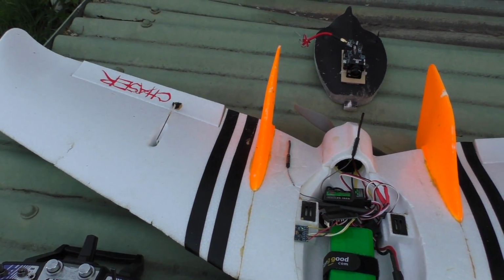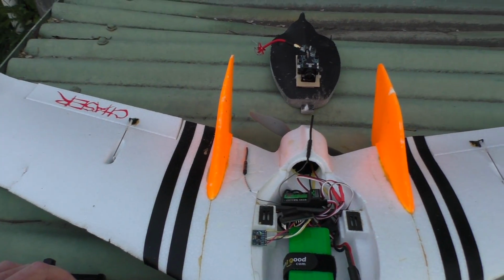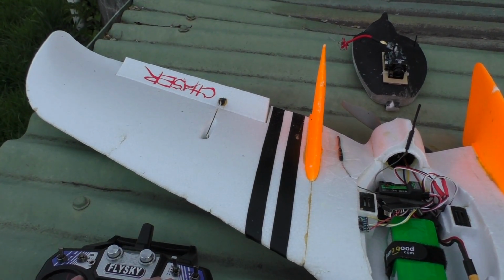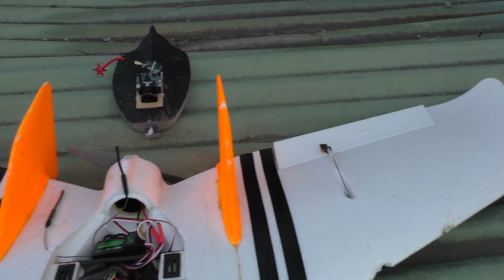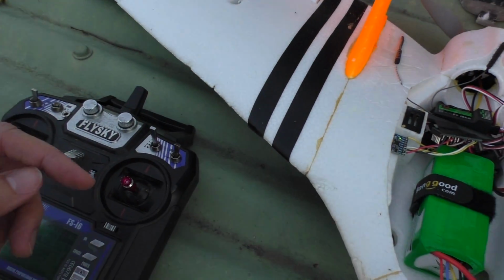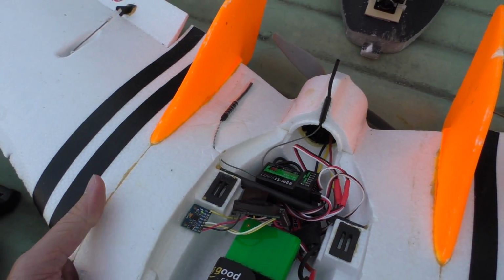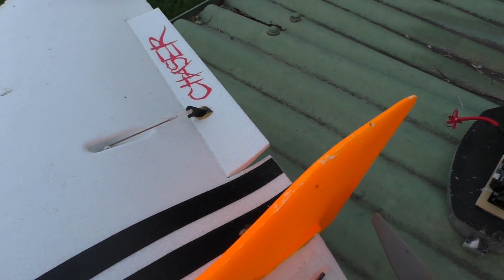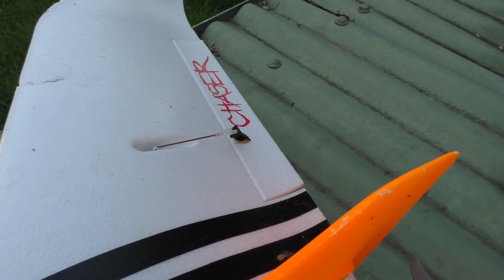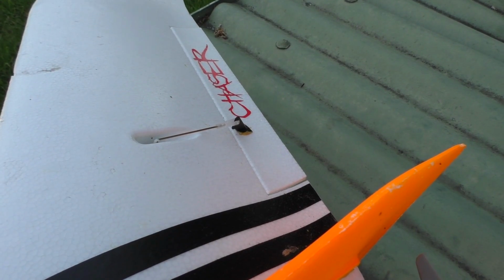So this is pass-through, and then if I switch into attitude hold, and I'll just flick the stick down a little bit, you can see how the elevons will stay there now, until I... what did I do? Down. So I want it to pitch up, right? So if I grab the plane and pitch it up a bit, you'll see that when I get to the angle that was the pitch that I input, the elevon will go back to the neutral position.